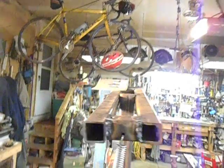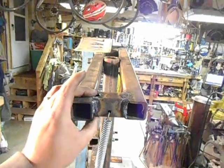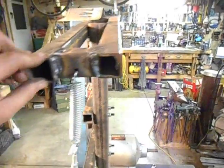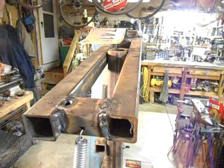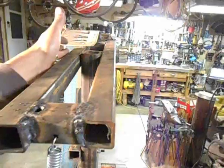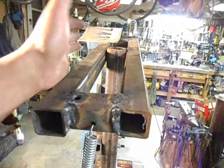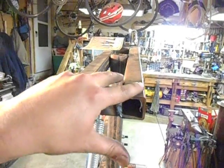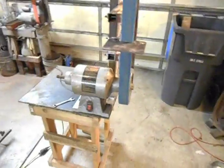The tracking arm is a little bit tougher. Basically I took two pieces of square tubing cut to about two-and-a-quarter inch as standoffs — one here and one up here — and welded the whole thing together. That bolt comes through the arm, and the double-arm design really cancels out any twisting. If you just bolt it on the side you have to leave it loose enough to pivot, but then it can twist in and out. The double arm means it can only move up and down once you get the bolt snugged up.